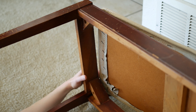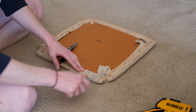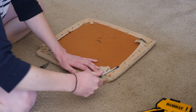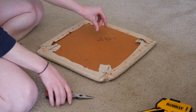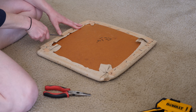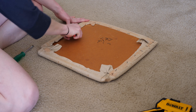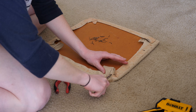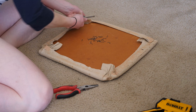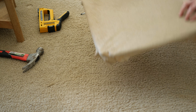Once you've removed the seat, start prying up the staples with a flathead screwdriver or similar object. Pull them out of the wood with the pliers. If you're new to upholstering, pay special attention to how the original piece of fabric is attached. This will help you put it back together with the best results. The first reupholstery project I did was on a wingback chair — I took a lot of pictures and I needed them. You'll think it's fairly straightforward and that you'll remember, but trust me, you'll use those pictures for reference. This cushion is obviously a lot simpler than reupholstering an entire chair, but it's worth it to make note of the folds on the corners.